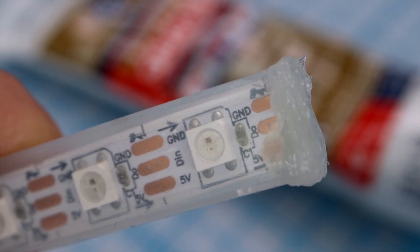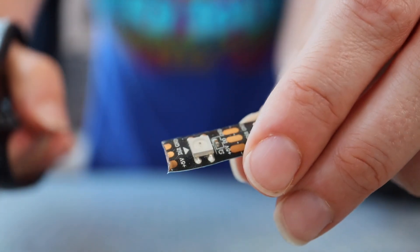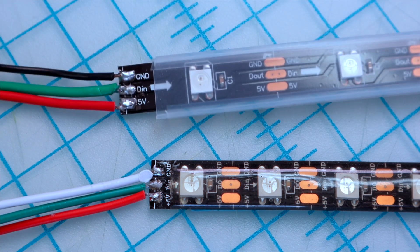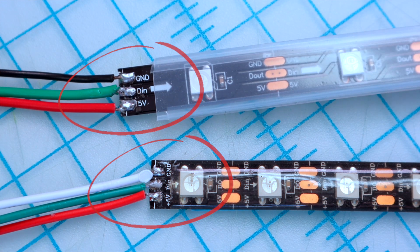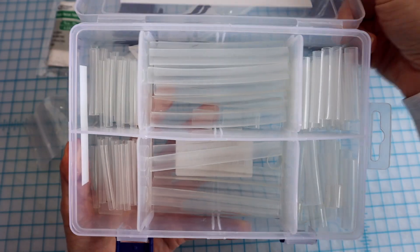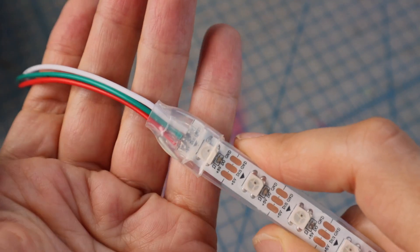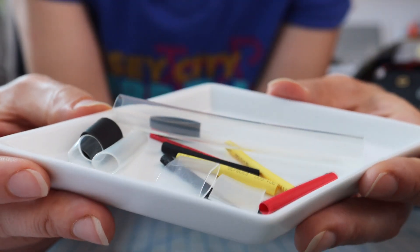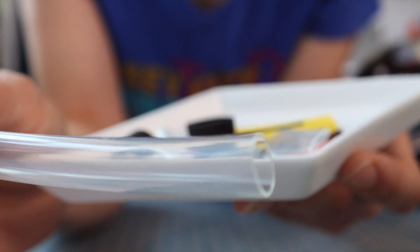No more water in here. The gel strips keep their covering on when you cut them, but to solder to them, you need to peel back the gel coating and remove its waterproofness. So in both cases, we need to seal the wire end back up. The best way to do this is to use heat shrink. Heat shrink is a plastic tube that shrinks when you heat it up. It creates a seal and strengthens your strip and the soldered joint. This is a good idea whether or not you need it to be waterproof. You can find all sorts of heat shrink, but my favorite is the clear kind — this keeps the connections visible so I can see if any of them have failed.